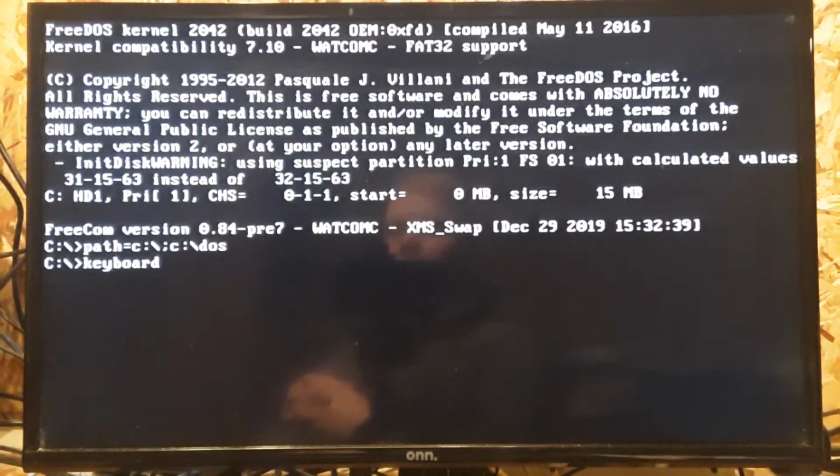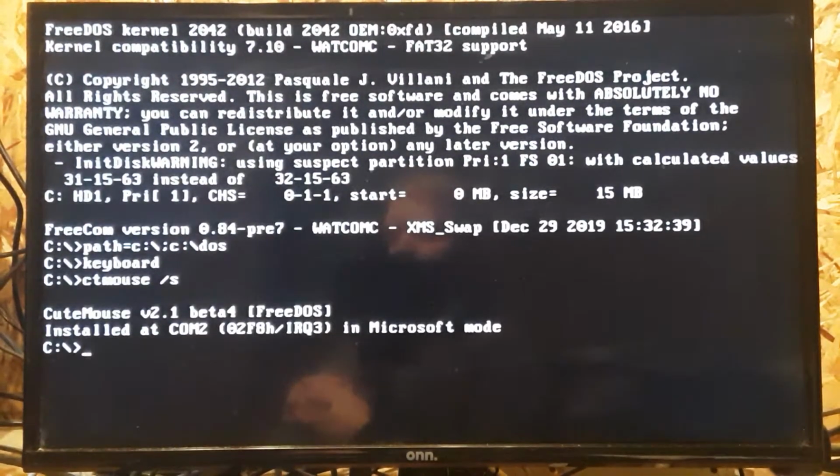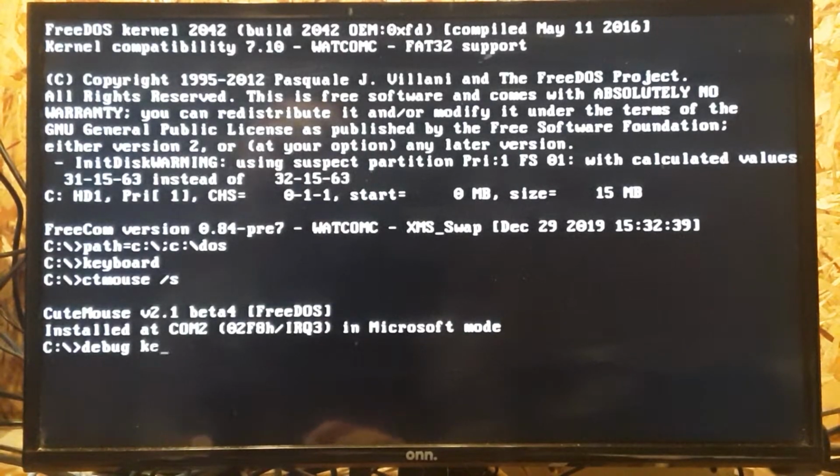See if we can get the screen to come on. So you hear that toning, and that's what I have to correct in the code as well. Starting FreeDOS. There's our keyboard batch, well, it's not a batch file, it's a COM file. And that corrected the keyboard and the speaker all at once. So now, see, keyboard types. Let's look at our COM file real quick.